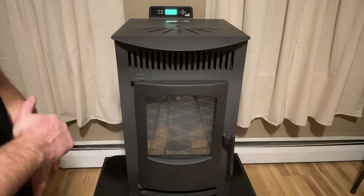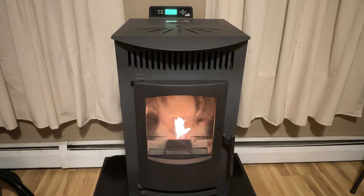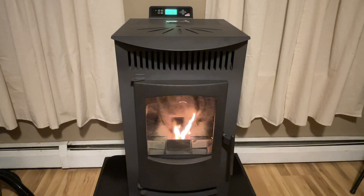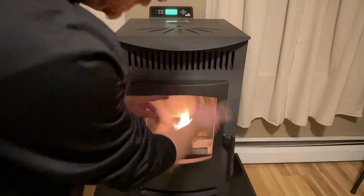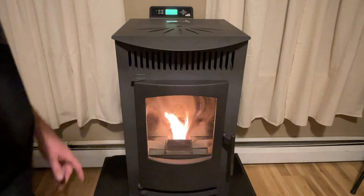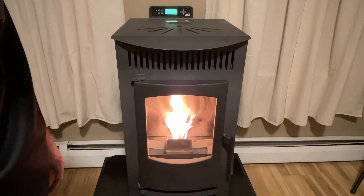You'll start seeing embers blowing around. It fires up pretty quick and doesn't fill up that much with smoke. You can hear the air flowing through it now. That fire is not lazy — that baby starts getting warm. That's a strong flame. See what I was saying earlier: if you have that ash tray centered in between the pot and drop those guards down, the embers that are flying around will land in there. You don't want one side sticking out because those embers are going to get sucked out through the exhaust and right up into the dura vent, and you'll have embers flying out the back.